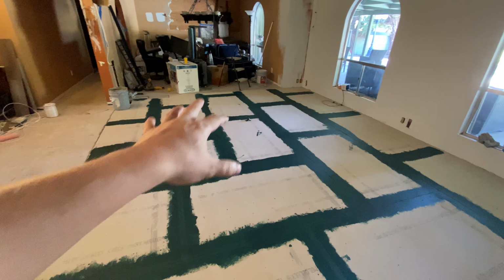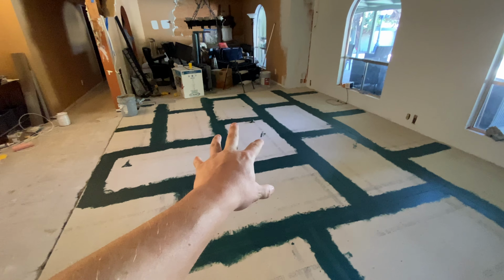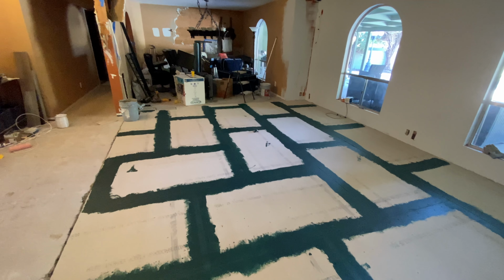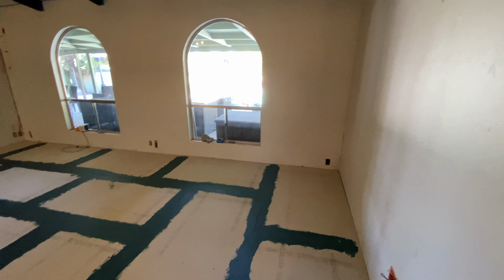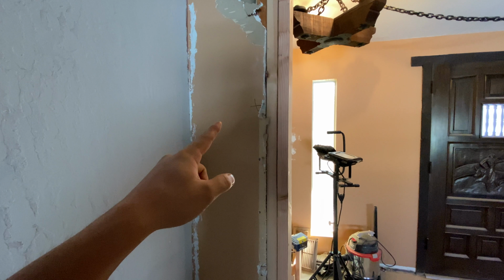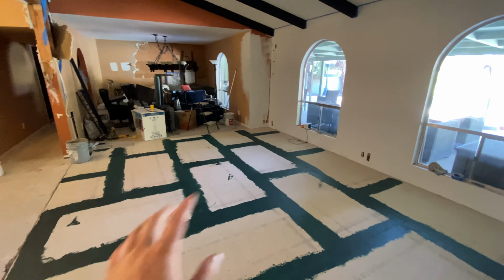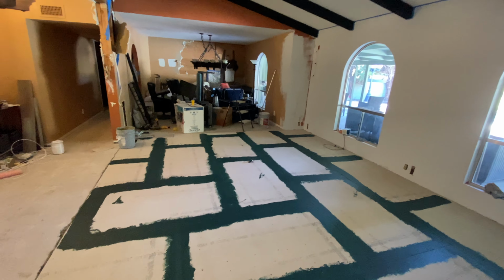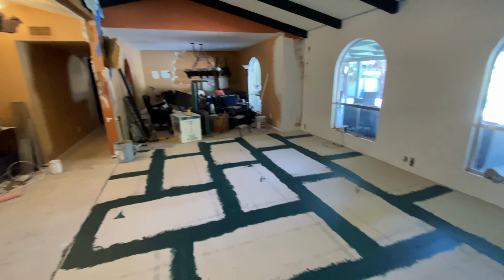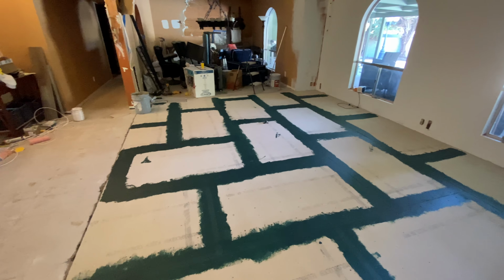While we were down there, you can't really see it, but there's an electrical outlet right in the middle of the floor. So we're going to put a flush mount on that. Not quite sure what we're going to do with it yet, but while you've got the floor out, might as well run electrical, right? And then in the corners, 1, 2, 3, and then 4 down here, to possibly do Atmos. Is it Atmos for atmosphere? I don't know. But the Dolby upward firing 3D object voodoo stuff at some point in the future. So I ran 400 feet of speaker cable that's all going to terminate here. I can't believe how much speaker wire it is for just this one room.